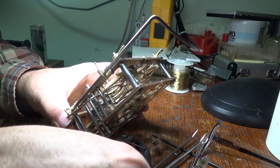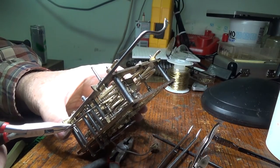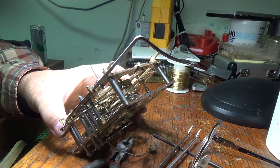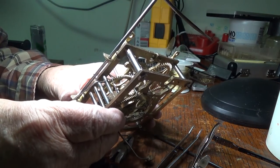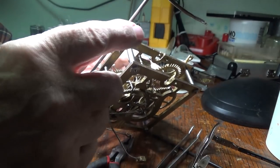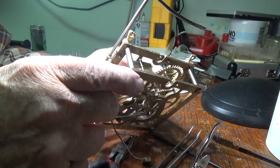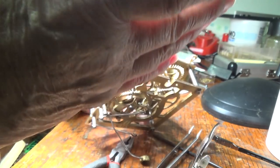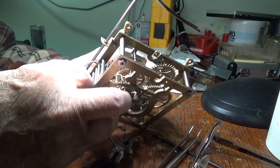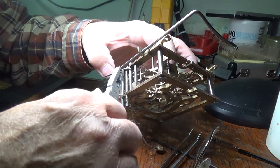So I'm pushing that open, that makes the bird go out. So you have to make some adjustments depending on where this has to be in your case, where you attach the bird. And you're going to have to make some adjustments in the bend in these levers. I'm going to assume that the bird is going to be about level. Thinking this goes on the back of the case, the bird's sitting here, then this has probably got to be about parallel with the plates. So that has to go in just a little bit to hold that bird in that position. So I'm going to bend this in,